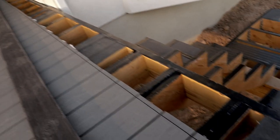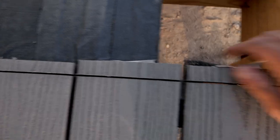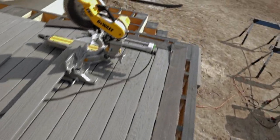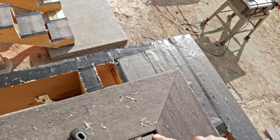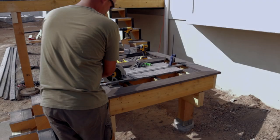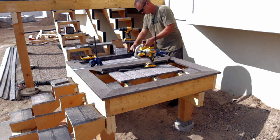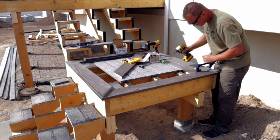Now that we've made our cut all the way down to straighten this out — you can see exactly why we need to do it. You can pretty much break these off and it does a pretty clean break. To install the frame around the outside you lay it down just like you did all the others. The only difference is the 45-degree cut on each edge and that I have to use the Cortex hidden fasteners to secure them. For the stair landing I'm doing the exact same design, so every step I did on the deck I just repeat down below. If you want to see how we built these stairs, click the link above for a full tutorial.